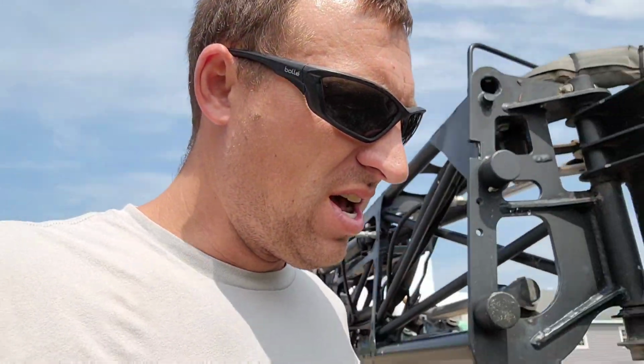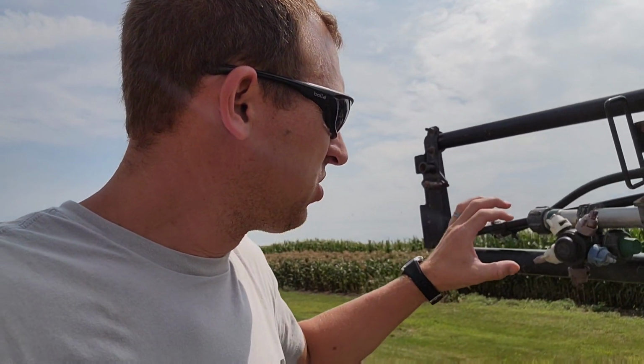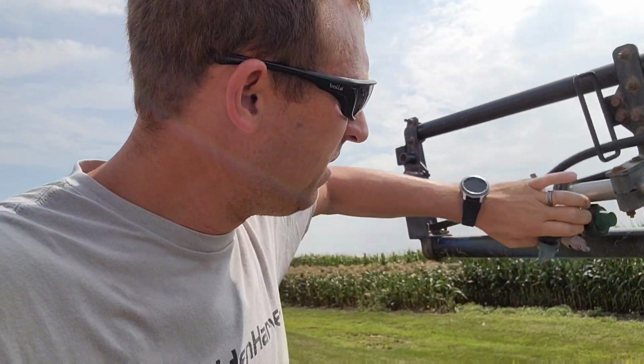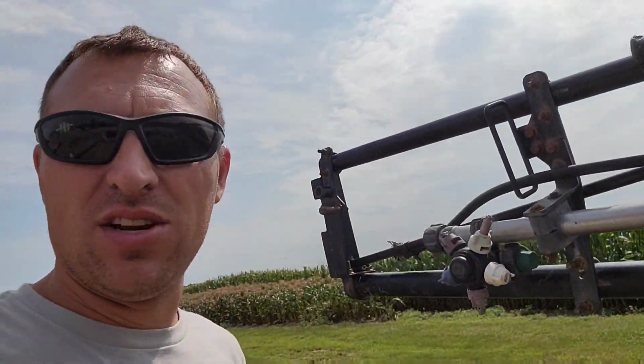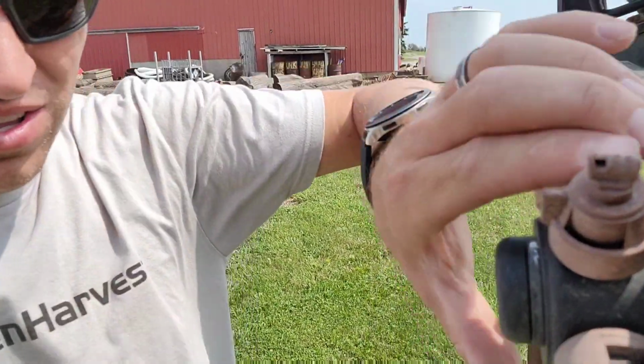So that'd be 12 and a half gallons on our first load here. Since we are spraying a herbicide and not a fungicide or an insecticide, we need to switch our nozzles. Coverage is still super important, especially with the Liberty, but we don't need that super fine droplet that's trying to penetrate the canopy as much, because quite honestly, we don't have a canopy to penetrate. So instead of the twin jets, we're going to run the single hole nozzles, this one.